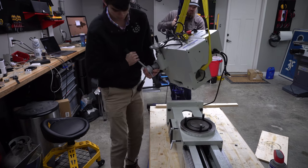I do want to point out that my mill's current configuration is about as simple as it gets. I have, or will soon have, control over 3 motors, 3 limit switches, and 2 probes for finding my tool and work offsets. More capable CNC mills will be able to adjust the spindle speed, automatically swap tools, activate coolant pumps, and so much more.